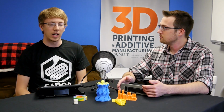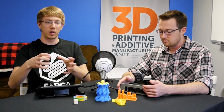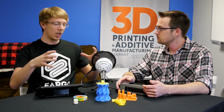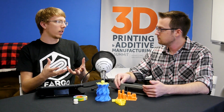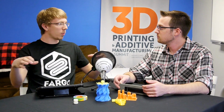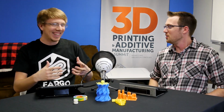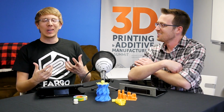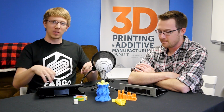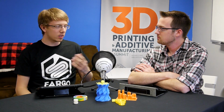Yeah, and sometimes you'll have to use a helper disc and then a couple other helper discs outside of that just to help with curling, because sometimes you'll get a giant mass of plastic. Let's say you're doing a box at 100% infill. Well, you can have more helper discs outside of those helper discs, helper discs on helper discs, and they're helping everybody. Yeah. So I know I did one circular part where it looked like a flower when I was done because I had all these helper discs, and it also helps with support.